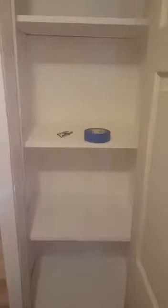On the inside we put some shelves that she wanted - very simple with the towels and all the goodies she wants to put in. We painted it the way she wanted. There you have it - that's the way to put trim on a door. When you get your trim, make sure you get the measurements from the floor all the way up to where the door jamb tells you to stop on the cut. If there's no little stop, you figure it out - about three-sixteenths to maybe a quarter inch gap, though a quarter is a bit too much. About an eighth to three-sixteenths gap is perfect. Make sure you cut your left side and right side correctly - the trim will tell you which way it goes.